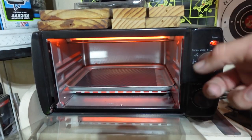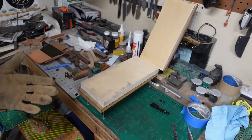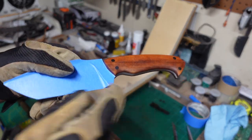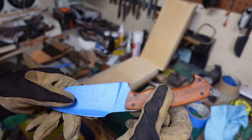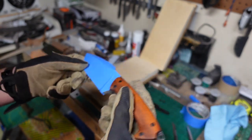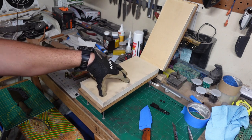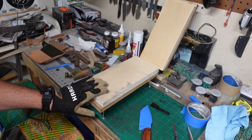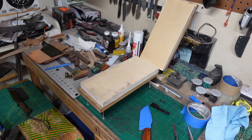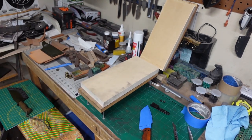So we're going to have this in here at 200 degrees for just about a minute. Before I put that in the oven, I went ahead and did two layers of tape on the blade, made sure and got down into all the little nooks and crannies so that all that stuff shows up when we press it. This particular foam here is actually for holsters and sheaths. You can get it from a bunch of different places, but I'll leave a link for it in the description below if you want to go check out some of this stuff. And then I just made the press myself. I'm going to use it, a couple of clamps, get it going.